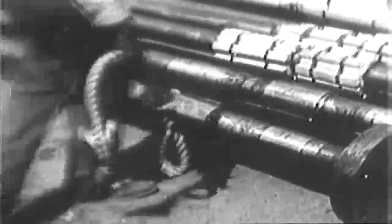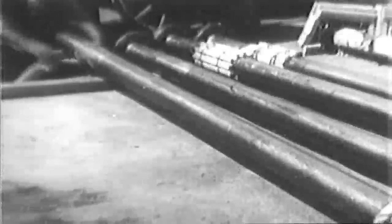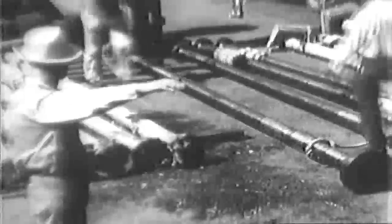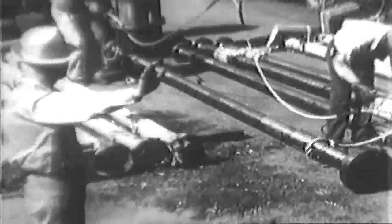Fiber rope is more flexible than wire rope. Note how this fiber strap grips the load. Lifting a steel shaft is a typical slinging job where fiber slings are used. Slings, with an eye splice on each end, are choked off around the shaft and will not slip or scratch the metal surface. Care to avoid sudden stress in lifting helps to prolong the life of the rope.